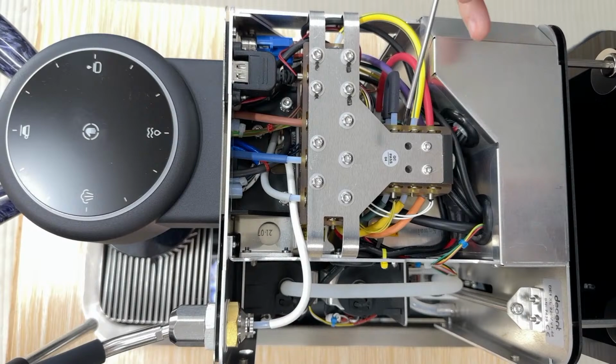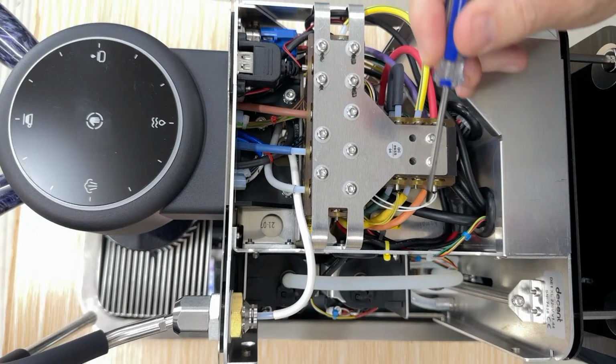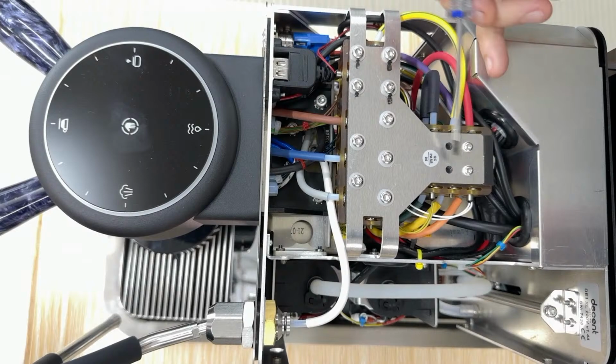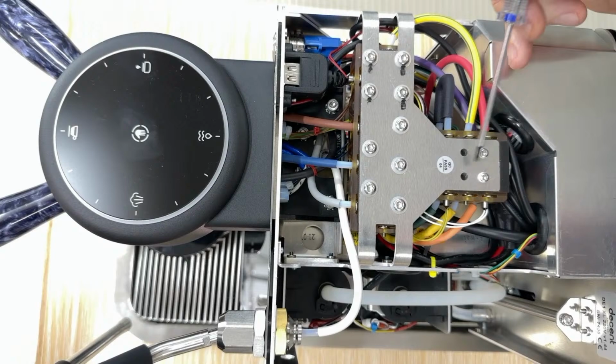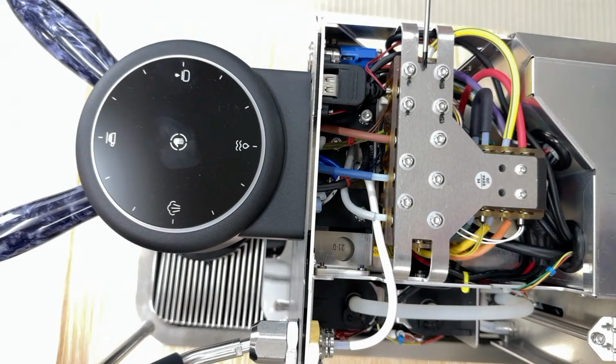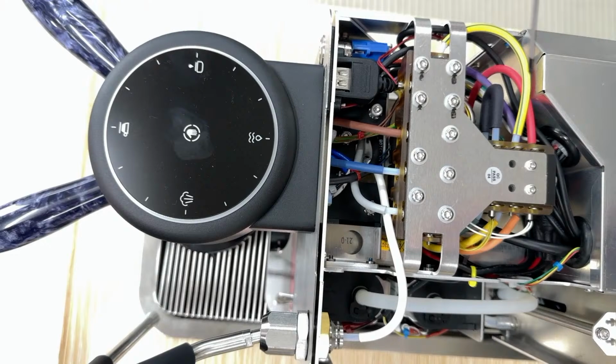I'll show you the heater in a second. And then this assembly here has two sensors, one measuring the cold water temperature, one measuring the hot water temperature. And they mix in various ways through here. There's a bit of chaos specifically in here because hot and cold water will tend to slide by each other rather than mixing. So that's what's happening through all this. And then this yellow and green tube is the main mix water temperature. And that goes into here, which is what we call our main manifold. Now you might notice every tube is color-coded, every sensor is color-coded, and often we try to give them meaning.